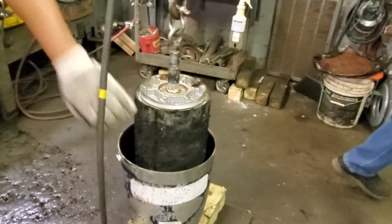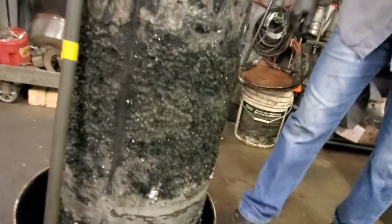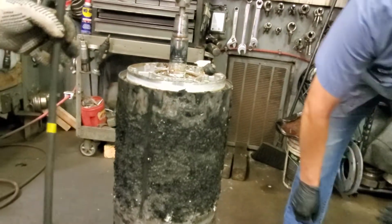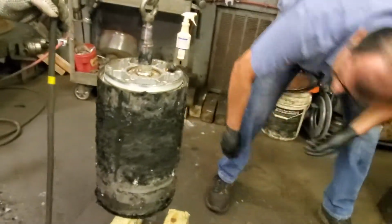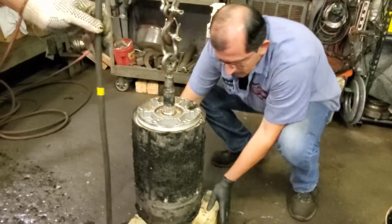So say they had the corrosion like this. A lot of corrosion on the stator housing. That means it got hot for a long time. So no cooling. It was hot for a long time with no cooling. What does a long time mean? Like what are you talking about when you say long time?